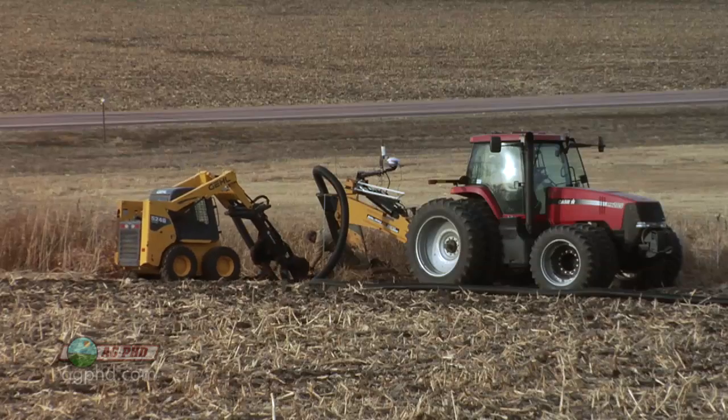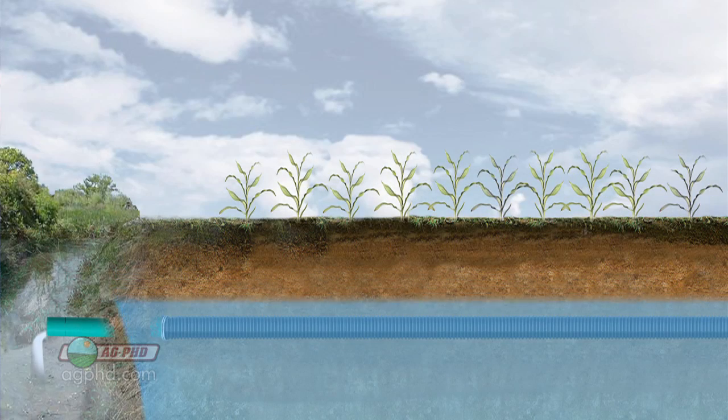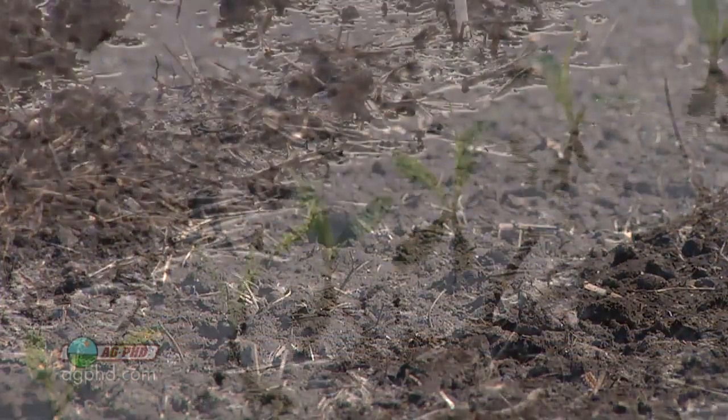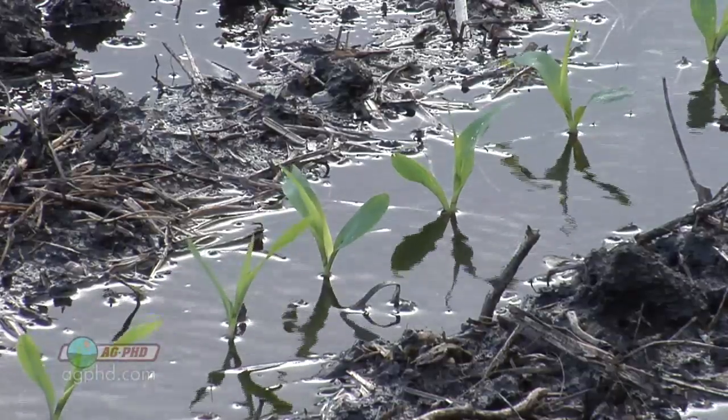The point is not to remove all the water, not even lots of water — just to lower the water table down to about 3 feet in the ground. Farmers are lowering the water table and getting that water level back to field capacity, around 25% water in the soil. The soil just can't handle 50% and still allow roots to really grow.